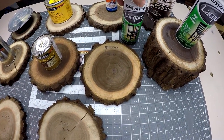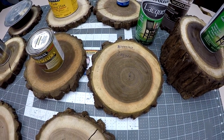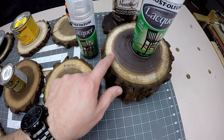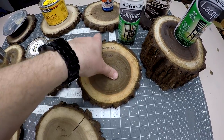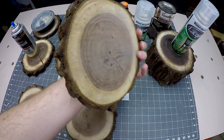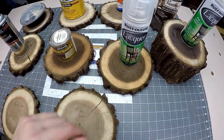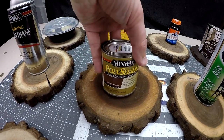Next I've got the exact same lacquer, but this time I microwaved it — I did four 30-second intervals and it really got steaming and bubbling, then I sealed it with lacquer. Lacquer wasn't the best option, but being that we microwaved it, it really did drain out a lot of the water and I don't see a lot of cracking — just a little bit. So a microwave option can help speed up drying, though I wouldn't use your indoor one; use an old junky one if you have it.